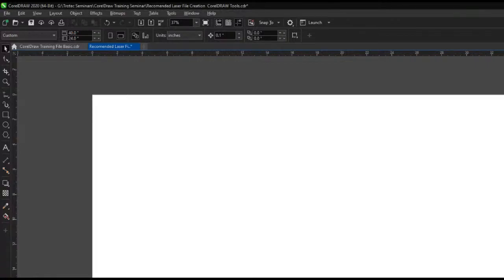They need to be, not lines, but circles and squares and shapes and stuff like that that you need to combine together. So the objects need to be a closed path. If you were to select that path and try to fill it and it fills up, you can combine it to another object. If it's not filled together, there are other ways to do that, and we're going to get into that coming up.